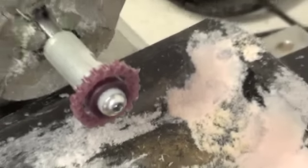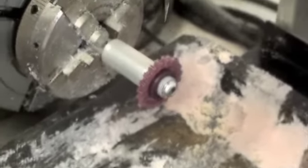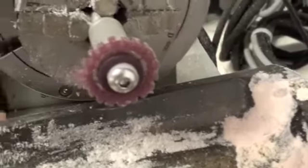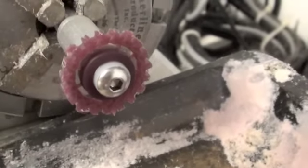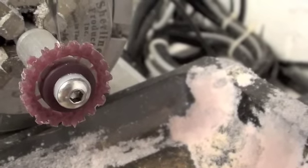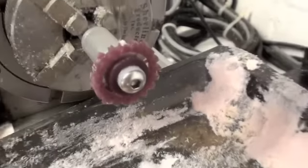I think we use RhinoCam for this. RhinoCam starts cutting from minus 180 and then works back around. See that's going really fast. So what that's going to do is it's going to work its way and cut away all the inside areas that weren't accessible before.